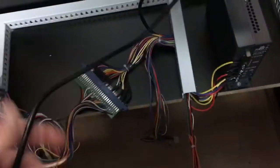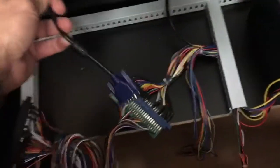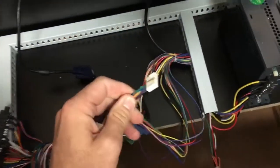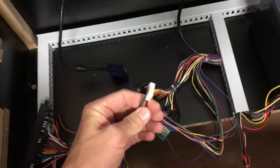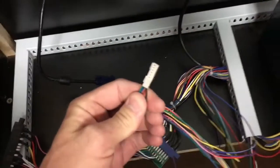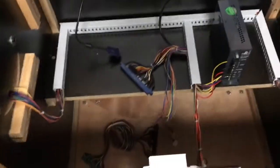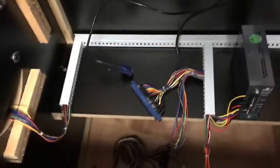In addition, there's a VGA cable coming from the monitor, and there will be a spot on the board for you to plug the VGA cable in. Last but not least, there's going to be a space on the board for the trackball if you've bought a game that requires one — it's kind of like a USB port and plugs right into the board. Please be sure the game is powered off when doing this. Once you plug in the board, the VGA cable, and the trackball, you can close the top of the game.